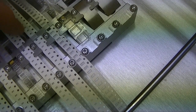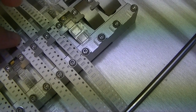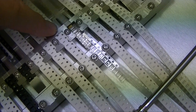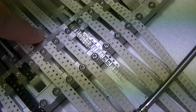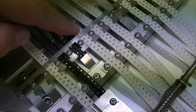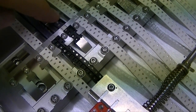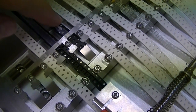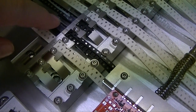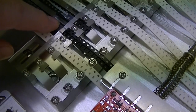Then next I've got a 10K resistor, then a 2K resistor, then a 10UF tantalum capacitor, a 1UF capacitor, a 0.1UF capacitor, and an 18PF capacitor for crystals — that's just in a strip, not on a reel. And here we've got yellow LEDs, which is the color we've been using lately with our red PCBs.